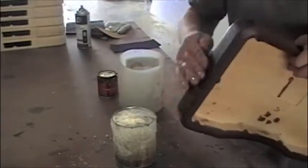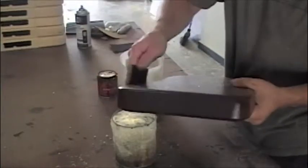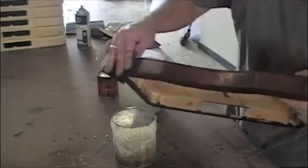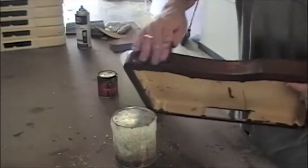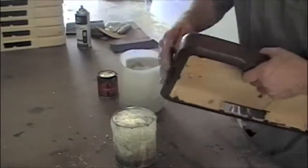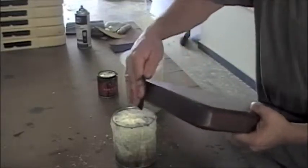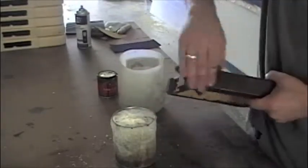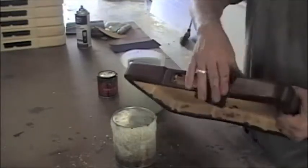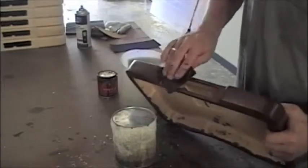Try to keep it flat — we don't want to take too much off the corners. If you're going to have runs, these are the areas on the end edges where the runs will be. Carefully look at that and make sure you don't have any runs, because if you do, now is the time to work on that. You can completely smooth them out, put more lacquer on, and they'll be just fine.